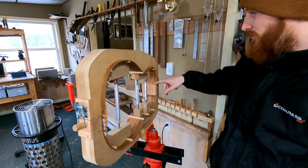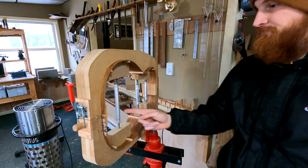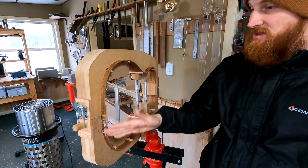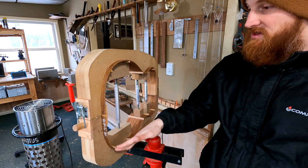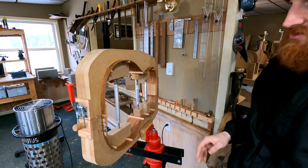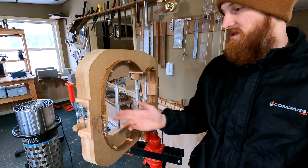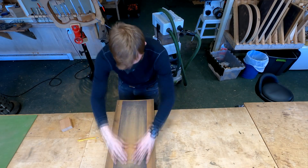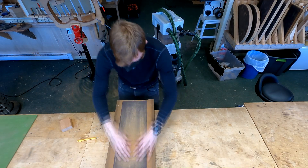The block is easy to conform to this shape prior to glue-up. The end block, however, follows a slight continuous curve — a 49-inch radius right here. I actually have a contour board, a special board that I sand this end block on to get it to match up with this exact radius before I glue it up.